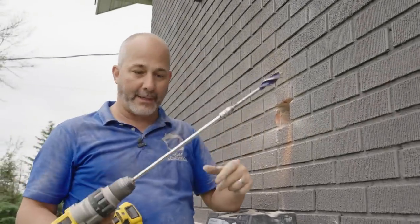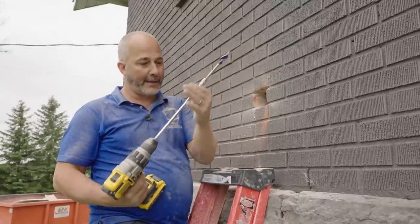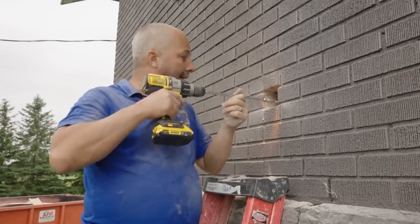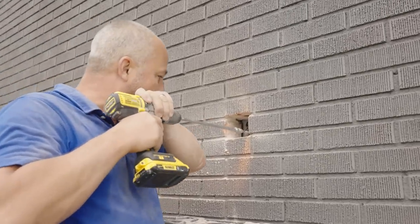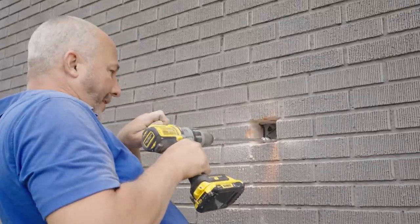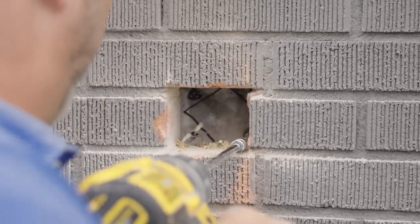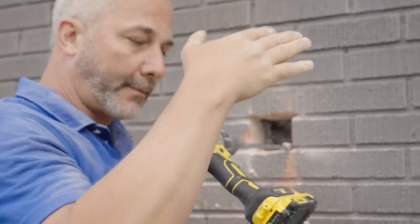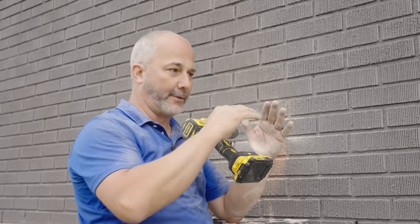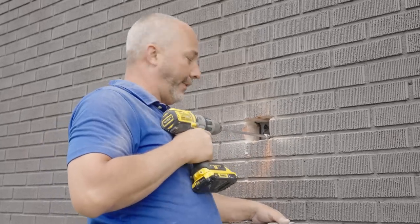The reason I've got this huge bit on is because I'm going that far in to get the wood — inch and a half to get through the wood and probably three inches of foam. Hopefully we don't blow up any electrical lines, but I've done my due diligence. That's really a lot more aggressive when you're standing on a ladder. So that was OSB sheathing — you've got a rim joist and then OSB sheathing. Those self-feed auger drill bits don't do anything in that, they just mush it up and you really have to force your way in. But now that I'm into the wood, it'll pull right through. Now I'm into the foam.